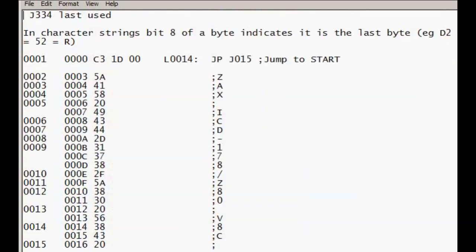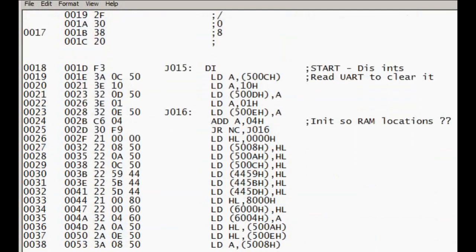One of the things that had me going for a while was this text at the beginning. Looks like it's a text string, and the instructions for most of these that I could find say that the unit announces itself with something very similar to this when you boot it up. So I spent some time looking for the code that actually uses this to pass it out to the RS-232. Bear in mind that at the time nothing was coming out of the RS-232. But it turns out this appears to be non-functional. It's just here for information only, and it's never actually accessed by the system.